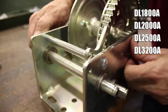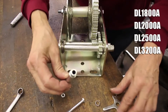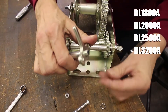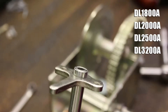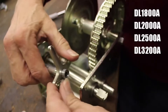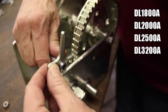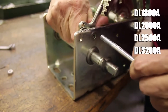To install a new kit on one of these four winches, such as this DL-2000A, place the lever on the tapered edge of the ratchet sleeve with its pointed tip on the left and facing down. Next, place the spacer against the lever on this tapered edge. Insert one end of the spring in the hole above the lever's pointed tip, then insert the other end of the spring in the small hole on the gear side of your winch.